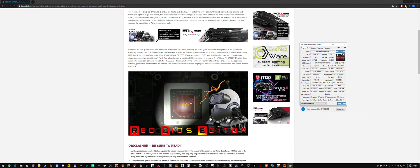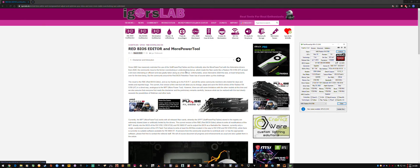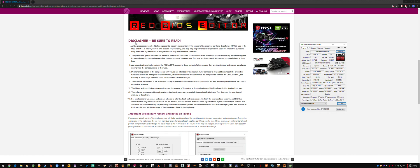Because this guide can be a bit overwhelming for newer people, that's why I'm doing this video. The disclaimer basically says you can break your card — if your system is brand new and you haven't stability tested it, I recommend at least a light stability test first. It's not resource-heavy to flash the BIOS and it's very quick, but if you get a crash or lockup mid-flash, that's what can brick your card, especially without a dual BIOS switch. You can also unbrick a bricked BIOS with a dual BIOS switch by switching to the bricked side while the system is running to recover it.